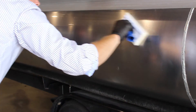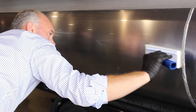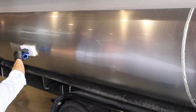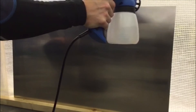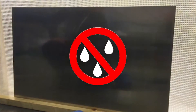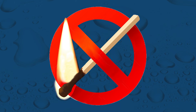Using the applicator pad is just as easy as the microfiber towel — back and forth in the snake-like format, in four by four foot sections. Always check your progress by looking at the surface from the side to assure no spots have been missed. Finding a systematic pattern will help eliminate missed spots or streaking. When working on welded sections, go the direction of the weld to assure complete coverage. A standard electric airless spray gun can be utilized in a well-ventilated area, set at the low pressure setting, allowing very close application to the surface. This will help eliminate exposure to humidity coming into contact with the atomized spray. Note that this is a flammable liquid and all necessary precautions should be taken when spraying with an electric airless spray gun.